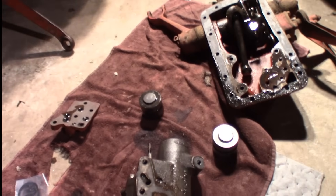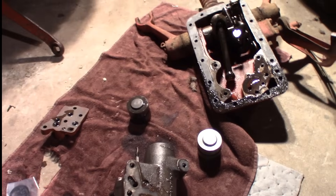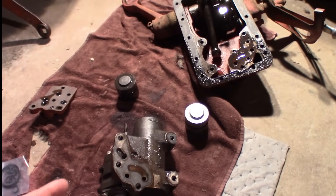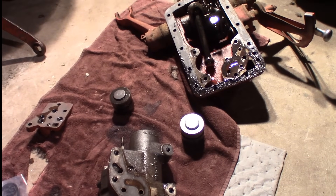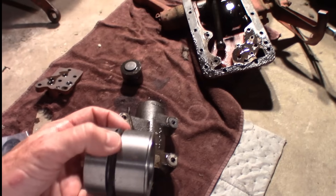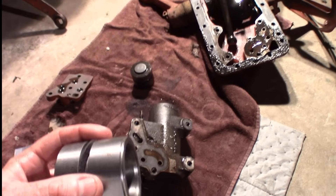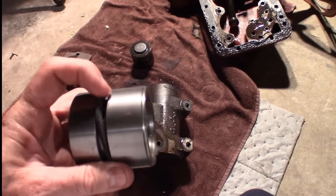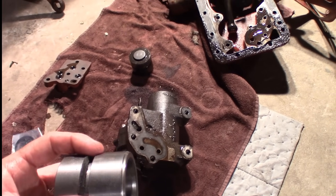I did check in the sump to make sure that there wasn't a bunch of gunk down in there, and it was pretty clean, so I won't have to dump this fluid. I was afraid I was going to have to change the fluid because the inside was going to be all nasty, but it's pretty clean. So: re-ring the piston, put it in there, put all the new O-rings in, clean it up, get the new gaskets on, and we'll get it back together. One note — on some of the older models, the 2N and 9N, instead of having the single groove piston with the leather and rubber O-ring, it actually has three grooves in it and steel rings, similar like an engine piston. Pretty sure they don't make that anymore. If you buy a replacement piston for the 9N or the 2N, this is what you get — with the leather and the rubber O-ring. It's an upgrade.